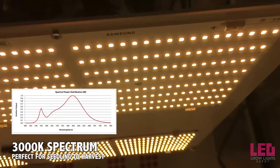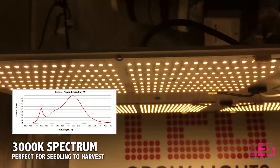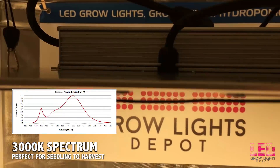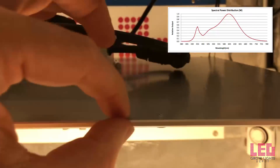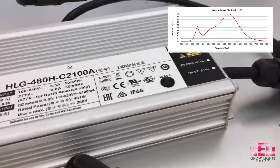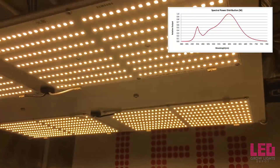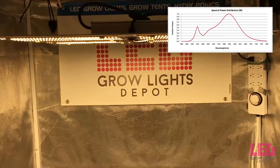The fixture's spectrum is full spectrum white with 3000K and 4000K options. 2700K and 5000K versions may be available on demand. 3000K is the most popular and ideal for seedling to harvest growth, while 4000K is best for veg but can also be used seed to harvest. 3000K is best for larger yields; 4000K is best for increasing quality. The white light spectrum lets you see the plant's natural colors. The spectrum has a medium amount of blue peaking at about 455nm and a large bump in orange-red peaking at about 605nm. There's also green for canopy penetration and some far red light, which combined with deep red can increase photosynthesis via the Emerson effect.